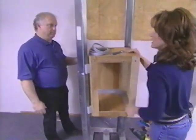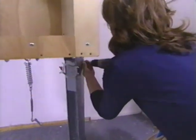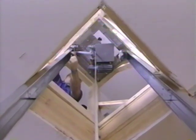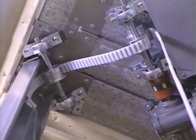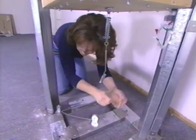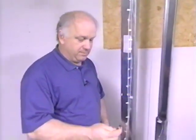I'll take the second stop assembly upstairs and install that. While you're doing that, I'll put in a couple of screws to attach this one. What I'm doing here is lacing the belt assembly through the pulley system. I'll hand down the return wire to you, and you'll install that down through the guide rail into the bottom of the lift container. I'm going to run this down the guide rail, put it underneath the first pulley and then under the second pulley — make sure the wire stays underneath both pulleys. Then take out the slack and we're ready to test it.